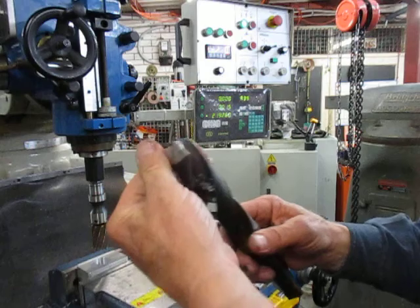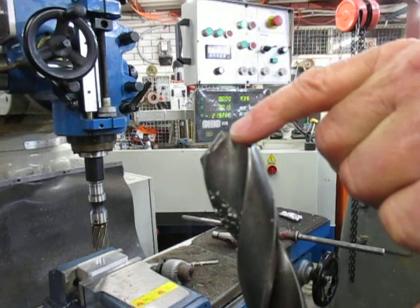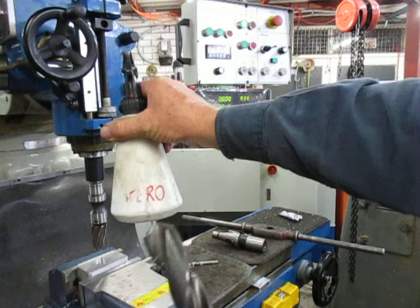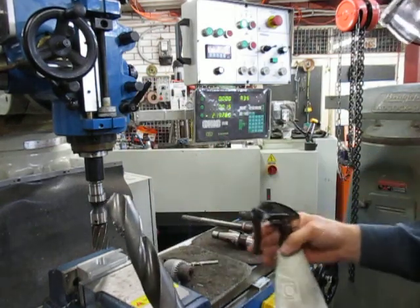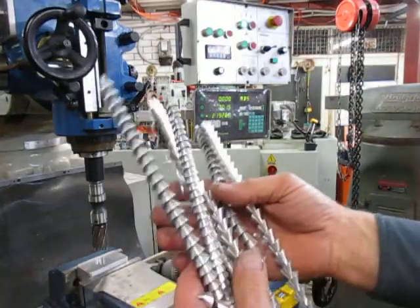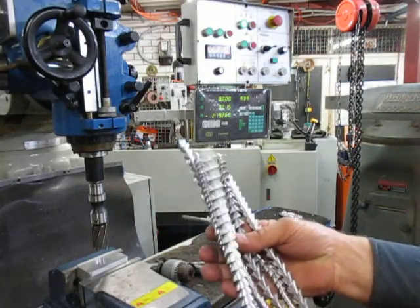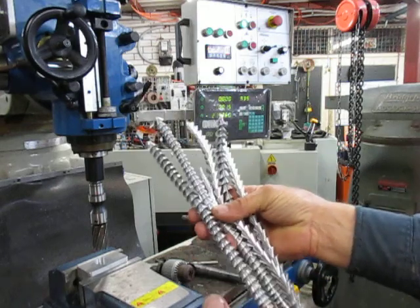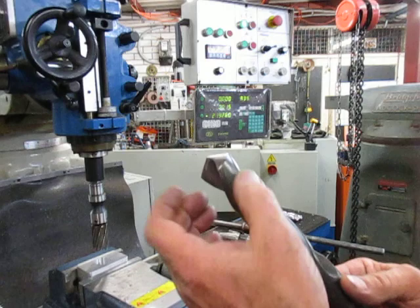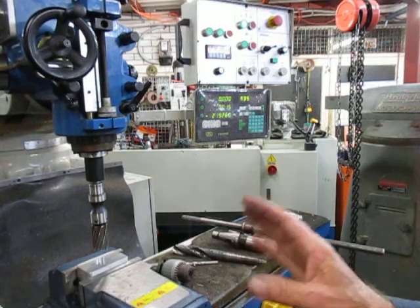This particular drill bit is a standard grind but I've also given it a groove back in here. With all my drilling in aluminium I use kerosene — I have my little squeeze bottle of kerosene and I use that liberally for the drilling, and of course we also do the pecking. While I was drilling with that I produced this swarf. You don't want any longer than that because it starts getting out here and can swing around and smack you. They are pecked every time to pull them out and keep it clean — that's paramount with any drilling. With the larger drills it's easy for them to come out of the flutes, but the smaller drills can be far worse, and aluminium, as much as it's soft, can bind up very quickly.